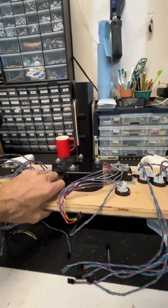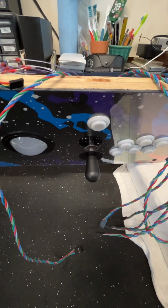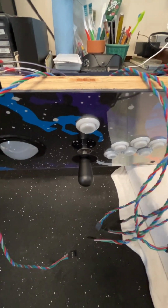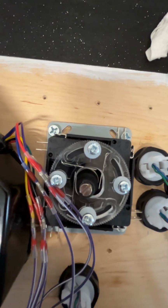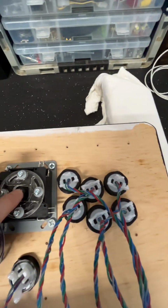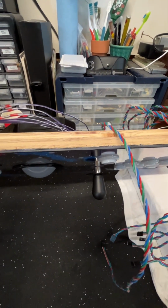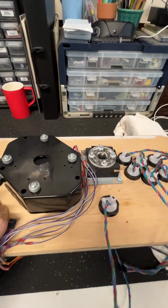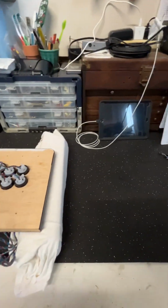The only other issue that I had was the length of the joysticks. These are the bat tops, not the Sanwa balls, but the bat tops. The ones that I really like, these that have these switches, are very simple, like old school. The one that I had was the Ultimarc 360, which used magnets and all kinds of things. It was too short, so I had to disassemble both of those and put them together, and I robbed the longer one from the Ultimarc 360, which was good because I was just about to order one off of the I-PAC website when I saw that these were compatible. You just had to take them apart. So that was a win.